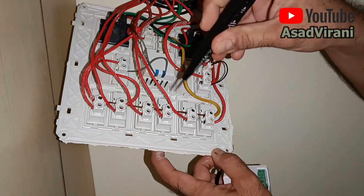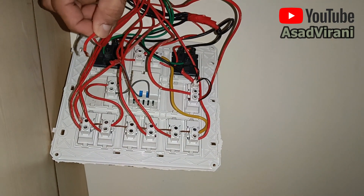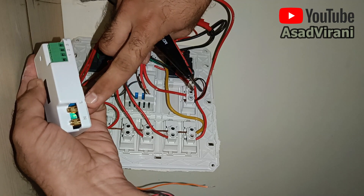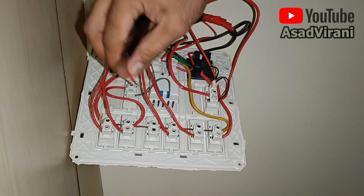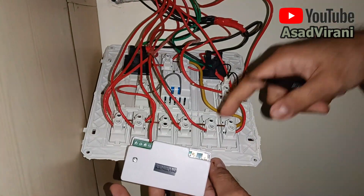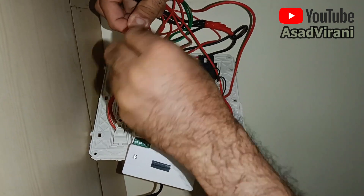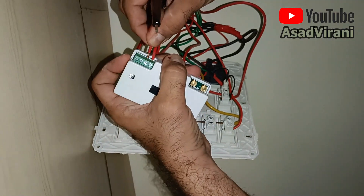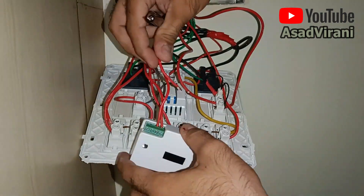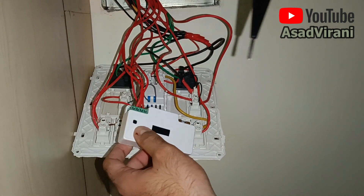I've identified these four switches. The procedure is very simple — all we need to do is remove the wire going into line number one, and put it into port number one of the smart switch. You can see ports one, two, three, and four here, along with the neutral and the phase or live wire connections. I'm fitting switch number one now, of course touching these wires only after making sure they are not live. There goes number three, and finally my fan.